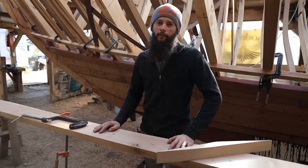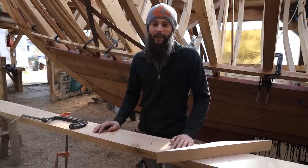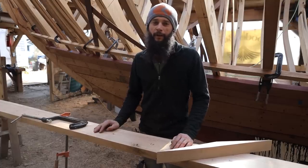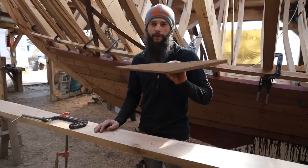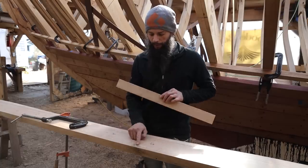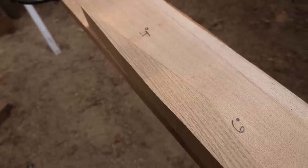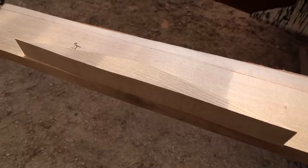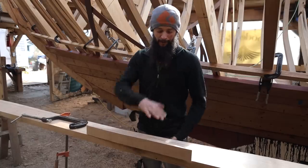Alex and Casey got this plank all marked out and ready to be cut. But before we can do that, we've got one knot we need to fix. We've got really great planking stock, but when you're working with timber — unless you have giant old growth or giant tropical hardwoods — you're going to have some knots to fix. So we've been putting in these tapered graving pieces. We've got a little knot here, so this graving piece would go in like that. We want to glue this in before we cut the plank out. One of the issues we've been having is that the clamps don't really fit in the glue boxes we built.